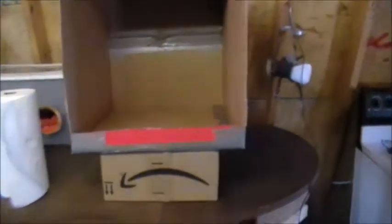I built myself literally a box. I ran a piece of stainless steel tubing through it so I can connect my ground on the outside to keep it from getting all covered in powder. I also purchased just a 2.5 gallon shop vac from Harbor Freight, and when I'm done powdering I just vacuum out the box. It's good to go.